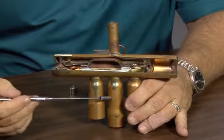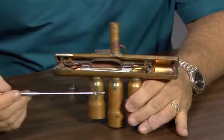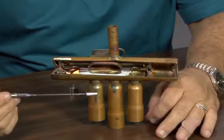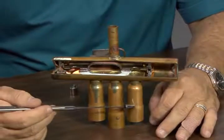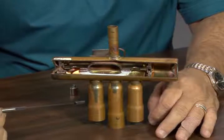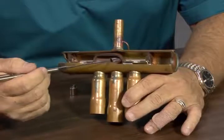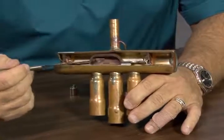The same with the center pipe on the bottom. That is always going to be suction. Heating mode, cooling mode, doesn't matter. The only thing that's going to change is whether this line or this line becomes discharge or suction. And if you look at the cutaway view of the valve, this little brass piece in here, it's cut open, but it's going to be closed.